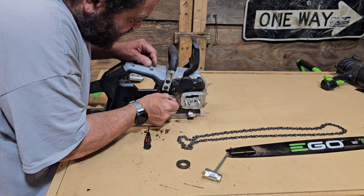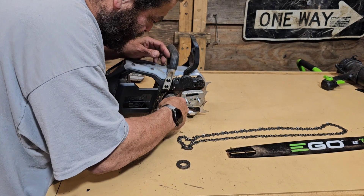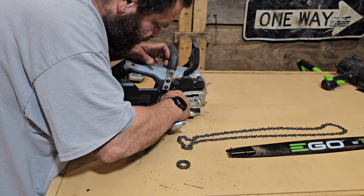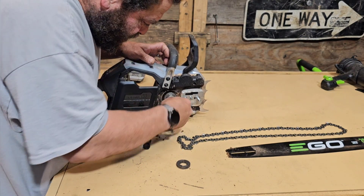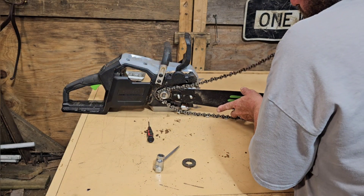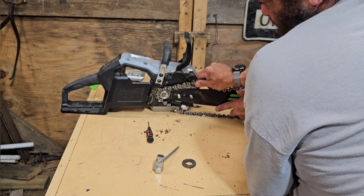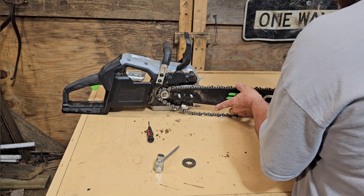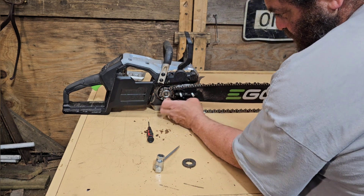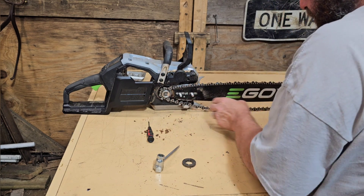Same thing — I'll just take that snap ring, and I know I'm blocking it with my hand but that's because I don't want it to shoot away. I'm just pushing it down with the flat part of this and it's on there. We did our cuts with the higher speed, now we'll go a little lower speed but we'll have more torque. I think if you're doing really heavy work and running into problems with heating because you're leaning hard on the log, that's where this is going to help out.